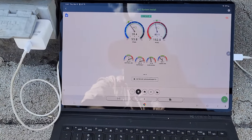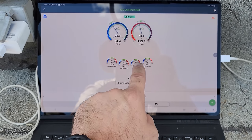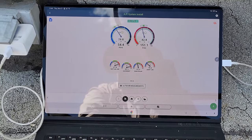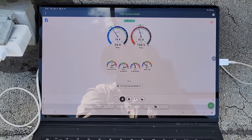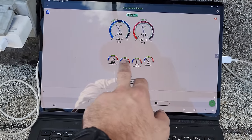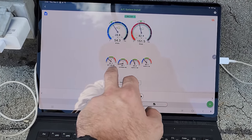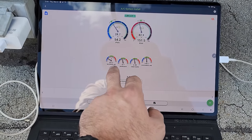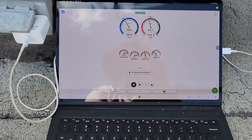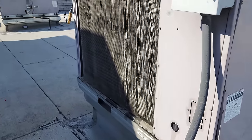We're going to let it run for a bit. At this rate we'll have to wait until it's warmer outside because we have no load - my saturation temperature just keeps dropping. We're at 28 degrees but subcooling looks good. Superheat's a tad on the high side but we'll analyze everything later. It's like night and day - both compressors are running and they're going to be okay. The temperature split across the unit is decent. I'm pretty sure the return air grill downstairs is really dirty - we'll have to address that on a PM. That's pretty much it for this one. There's not much more we can do when we don't have a load on the building.